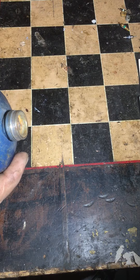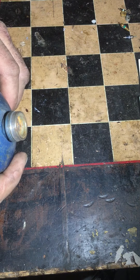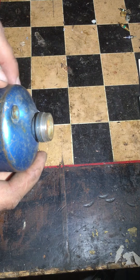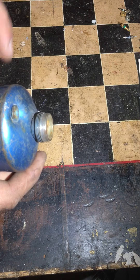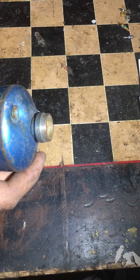Now, you want to be cautious with this kind of thing. Just because it's gassed off, if you leave it like this, propane that has embedded itself in the metal is going to leach out. And in a couple hours this thing's going to repressurize a little bit and still have almost that same amount of propane in there. So it's still going to be slightly pressurized and a bit of a danger.